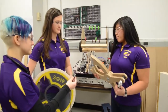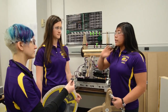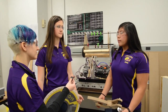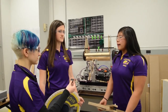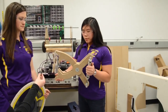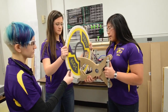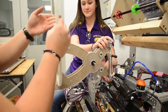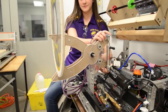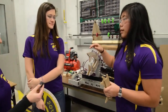So this is our claw prototype. We did a lot of research on how to pick up the hatches and a lot of teams were saying that they were going to be using Velcro. Unfortunately, we kind of felt like it would be unreliable. So we still wanted a way to pick up the hatch, but we weren't sure how to attain that. So we came up with this idea that it would be controlled by a piston, so it would hold on tight and hold the pressure. And when it came up, it would slide right on, hold on to the hatch, and you could just drive away. Of course, this is a work in progress. Our first attempt didn't turn out so well and we ended up with our pieces snapped in half, so we decided to layer it to make it more durable.